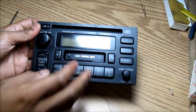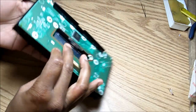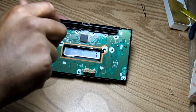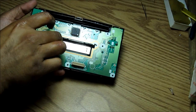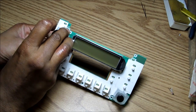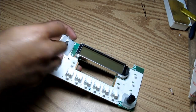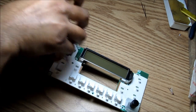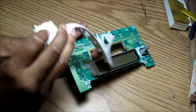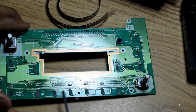The original color of the LEDs is actually green, and I want to change it to white. I'm going to start by flipping it over and removing a couple of Phillips screws to free the board from the housing. Then I'm going to remove the board, gently release the knobs for the potentiometer, pull off the diffuser, and remove the white contact pad for the switches. Here we've got the board removed from the housing.